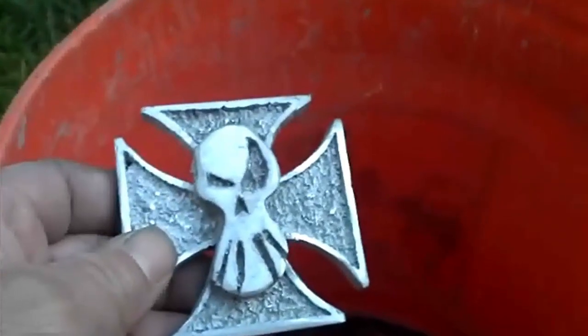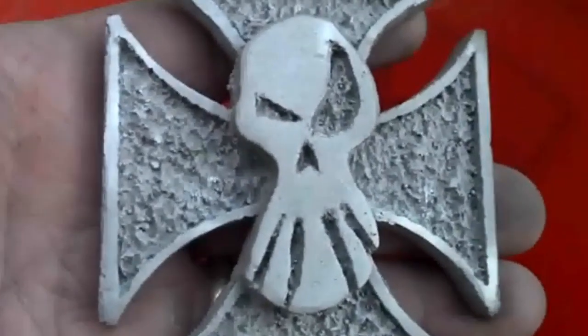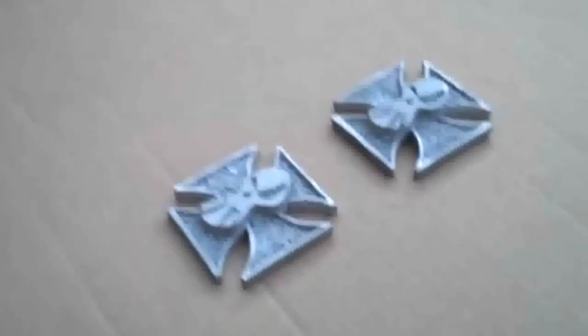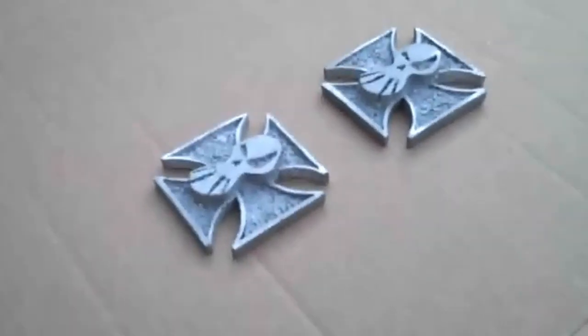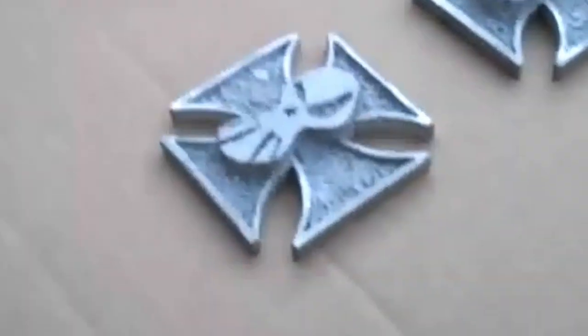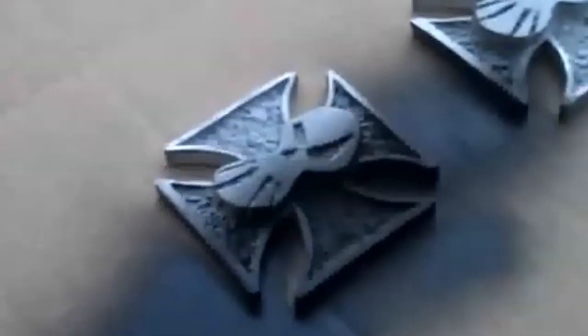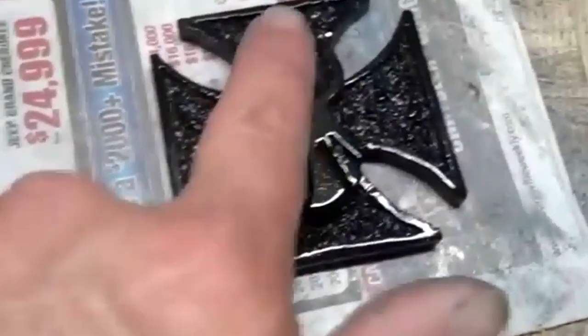Okay, here I'm ready to sandblast in my portable sandblaster. Okay, so there they are all sandblasted. Okay, the next step is to spray paint the recessed areas and the sides black. Okay, now I'm going to use a sander to buff off or highlight the edges that need to be silver, the top of there, and just the edges here.